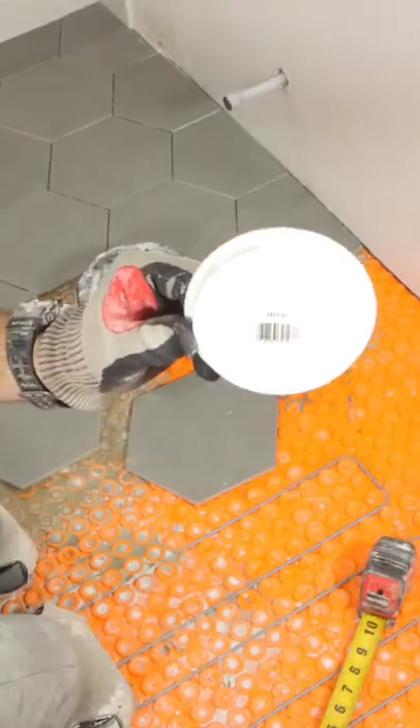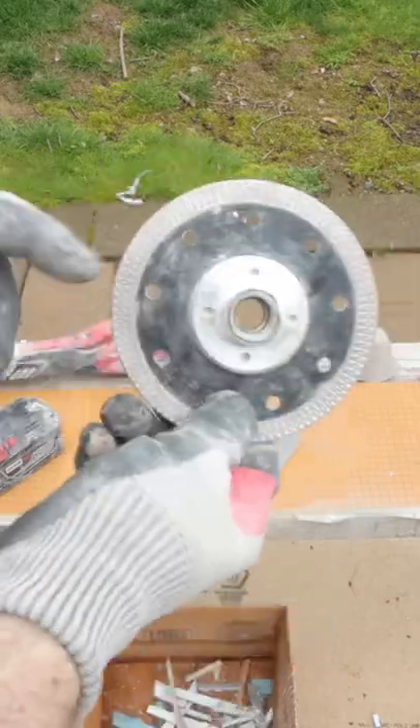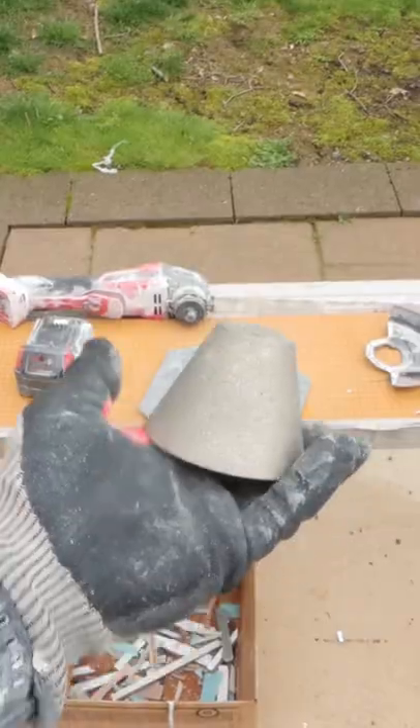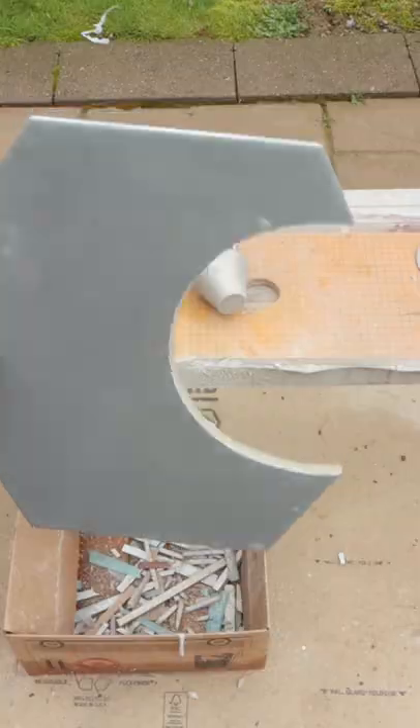How do you create a gigantic hole in your floor tile to fit around your toilet? I use a 4-inch cap to draw the semi-circle, then I use my Calidad blade to make sliver cuts in the tile, then knock out those cuts, and use my big boy chamfer cone to create a perfect semi-circle that fits nice and tight around the riser.